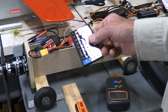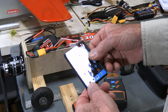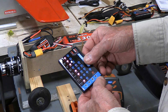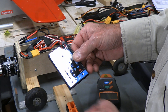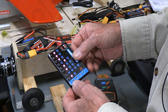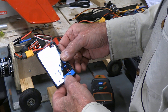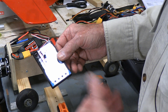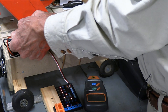We've shown you how to get up and down through the different selections just by pushing the button. When you get to a particular item — like cut-off voltage — if you wanted to change to low, you'd go over there and click OK. If you want to go back to how things were at the start, hit that one. If you want to keep the high timing rate, come over to high and click that one. You get a beep after you change something, and once you've got it all done, all you need to do is unplug it.